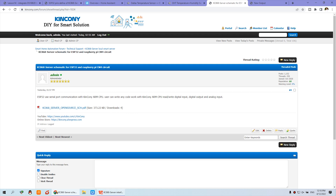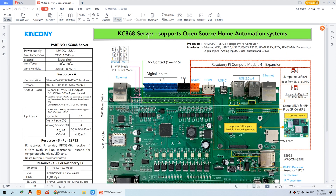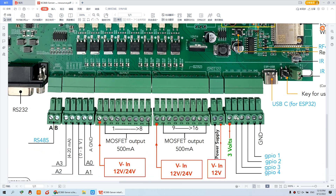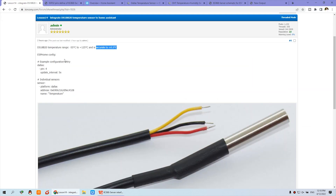You can also open this PDF file and you will see the KC868 server with many interfaces. For now, we just use GPIO channels 1, 2, 3, 4, so any one of these four points can be used. I have used channel I/O 1, so we can go back to the website.